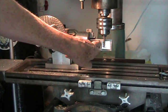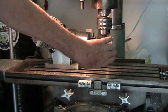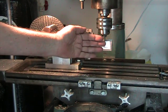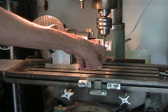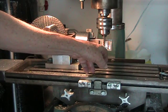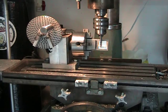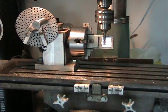I've already done one side — it's finished and I'm now working on the second side. You can see I've already started milling this out. In the initial process to get started, since I can't really rotate it a full 180 degrees, what I have to do is rotate it as far as I can and then go back and forth plunge cutting all the way down so that I get the initial part started. Let me zoom in a little bit so you can see what's going on.